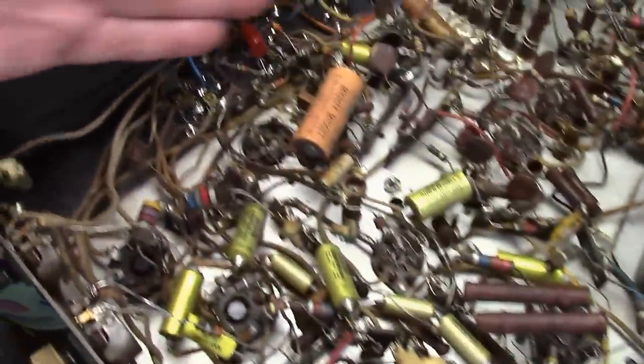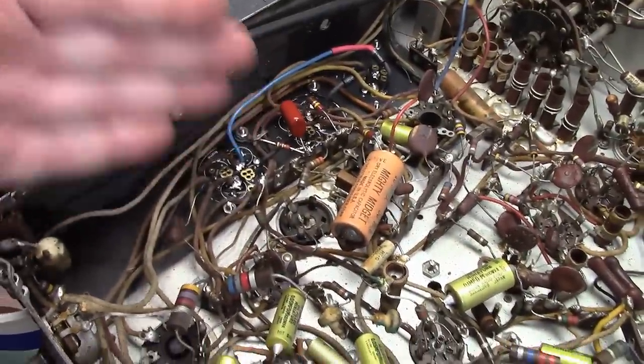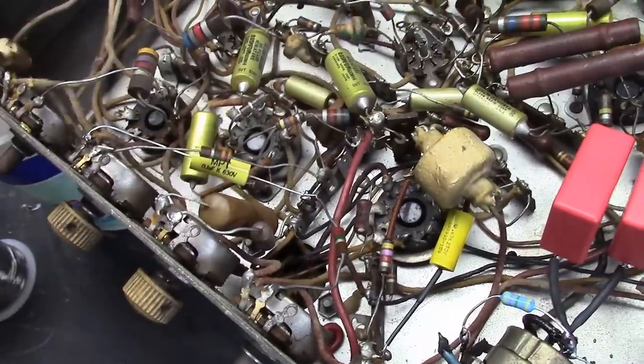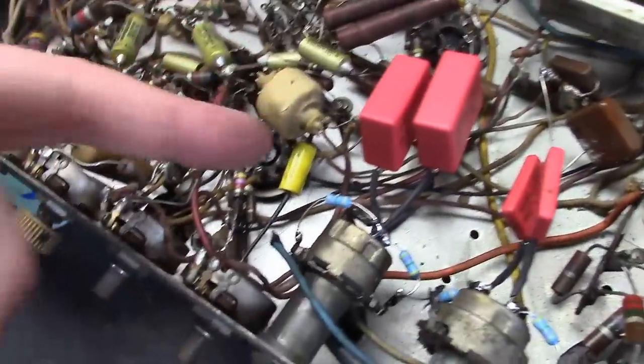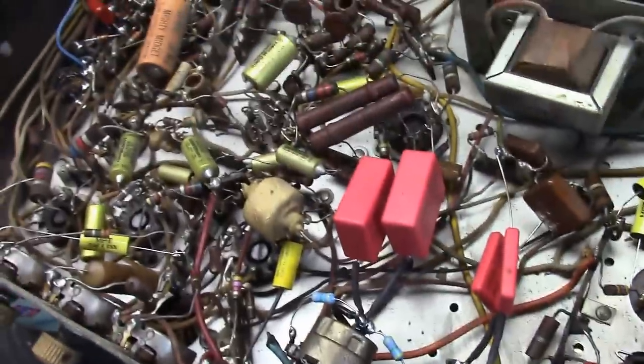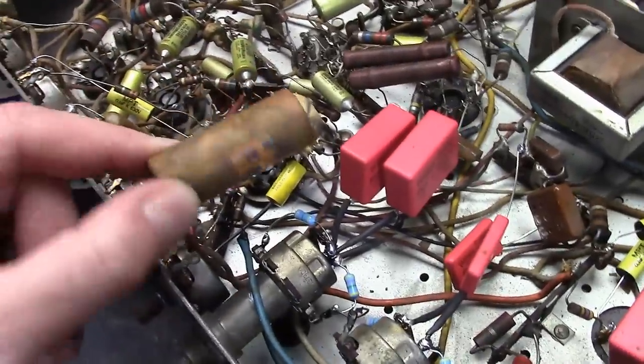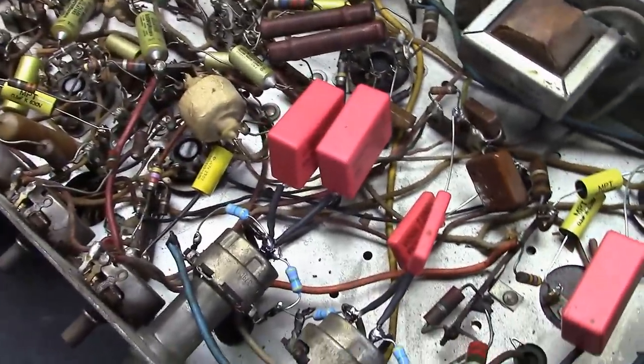And I finished rebuilding the power supply. And I replaced that one cap that we clipped out and tested. And there was another big old fat cap down in there. I think it was this guy, 0.5. I just replaced that just to kind of create some breathing room.